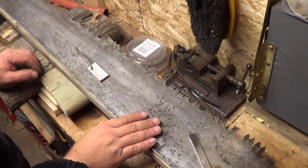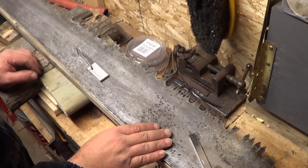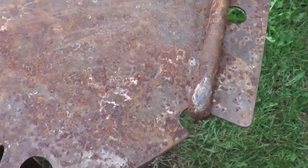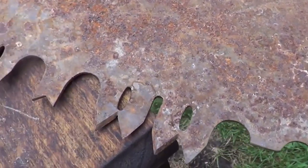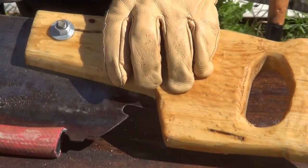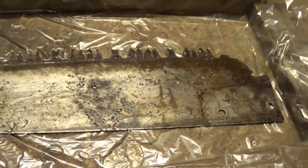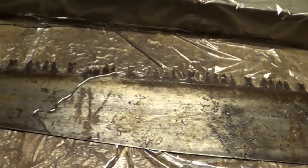I also heard that a sharpening stone with kerosene works well for cleaning the blade. I removed the old handle and made a new one — a lot more comfortable. And eventually I soaked the blade in vinegar for almost two days. This helped remove the rest of the rust from the teeth.